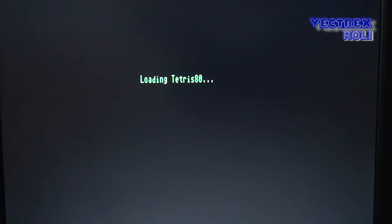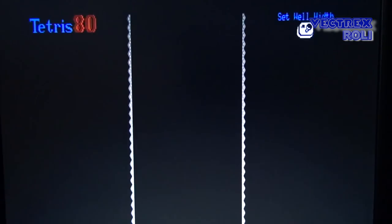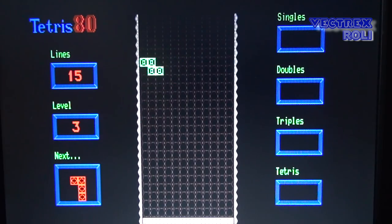The best option would be to use an old original Commodore CRT monitor that can handle both modes, but you can also use more modern LCD TVs or monitors, and you can use composite video or component S-Video for the 40 column mode, and you can get even special video cables and converters for the 80 column mode.